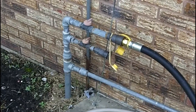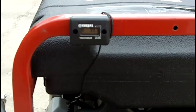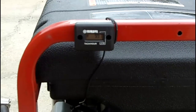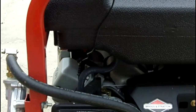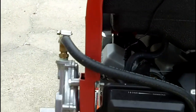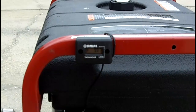I'm about to start it up and show you how it works. Another piece of equipment I forgot to show you: this is a tachometer and also an hour meter that I got off of northerntool.com. There is a small battery, and all you do is wrap the wire around the spark plug wire and it gives you your RPM, which you need to adjust the gas flow to get your RPM to 3600 revolutions per minute.